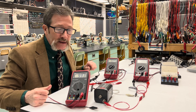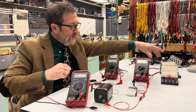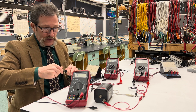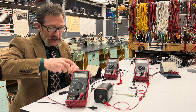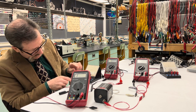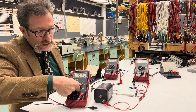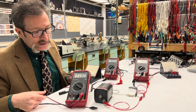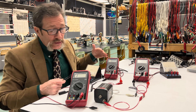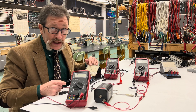We should really be talking about impedance — this one is going to have an incredibly high resistance. Let me do the same thing with one of our other meters. I won't need the million scale. If I simply put these leads across it, I can go way down. Now on the 20,000 scale, I'm at about 11,000 ohms. This meter has about a thousand times less resistance than the digital meter.